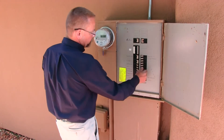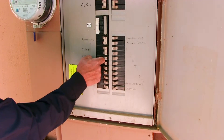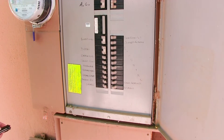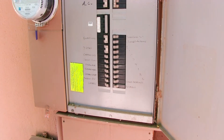These are all 110 volt breakers. Right here you can see lighting is from there to there. Here's a 20 amp circuit right here, and these are 15 amp circuits. You can tell because it's written right on top of the actual individual breakers what their amperage value is.